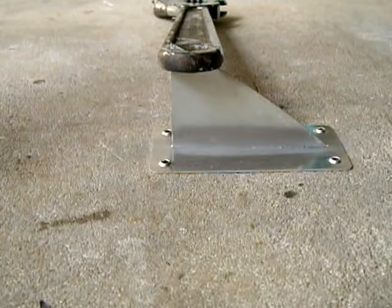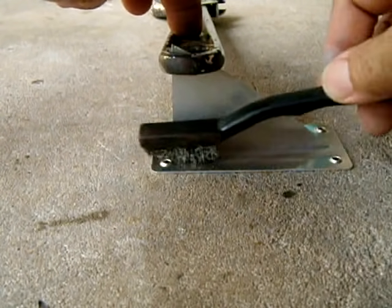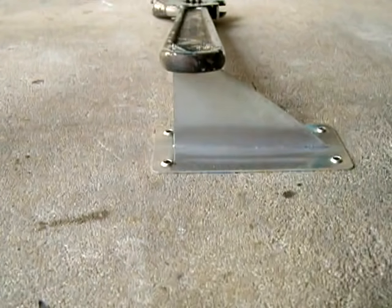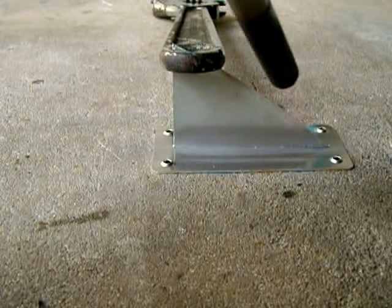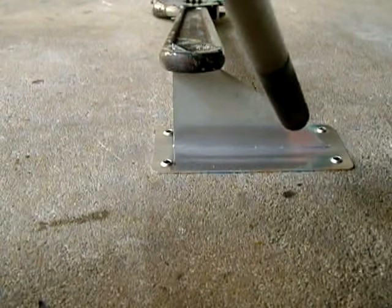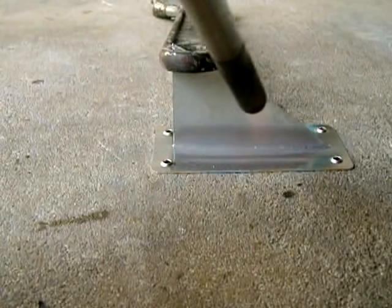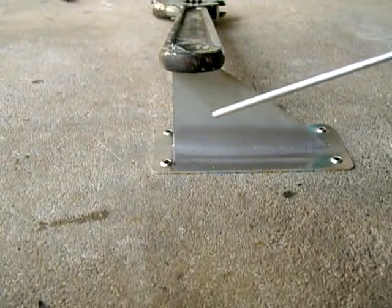I'm going to stop for a minute and push down right here. You'll notice when you're brushing it, it feels softer because the metal is softer — the bristles are cutting in more. Now I'll give it more heat and keep checking with the rod. The smoking you see is from the tape on the back side of the aluminum, the thicker one — that's what the smoking is from.